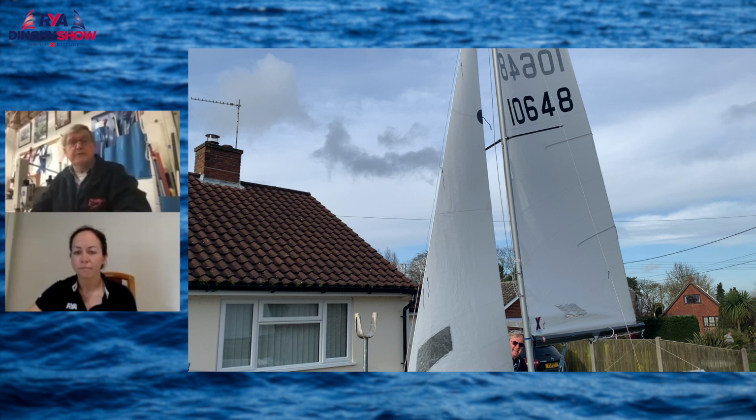Every unit the sheet moves through the fairleads, the middle leech, just below that leech telltale in the area of the spreaders, will move 5 times that amount. So an inch of movement through the sheet is 5 inches, a colossal amount. So we're not talking about giant amounts of movement. So once we've got the sheet angle about right, aiming just below the center of the foresail.